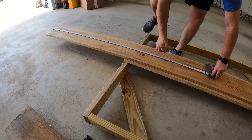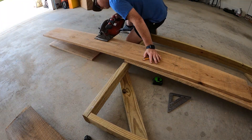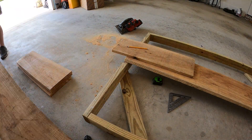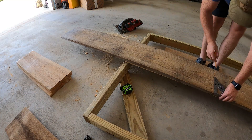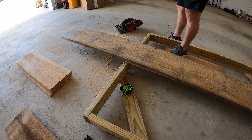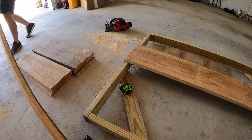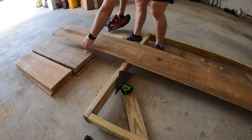The wood I am using to build this duck house is rough-cut cypress from my local shop. The reason for choosing cypress is that it will actually generate its own preservative oil, which makes it naturally rot resistant — an ideal choice for outdoor use. I am cutting these boards down to 33-inch length sections to make them more manageable to handle while going through my tabletop planer.